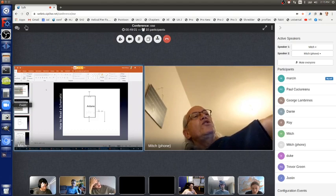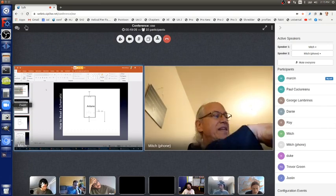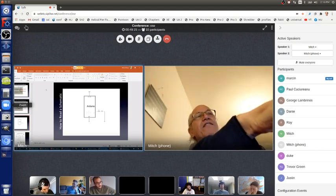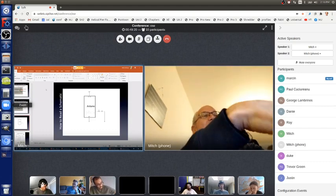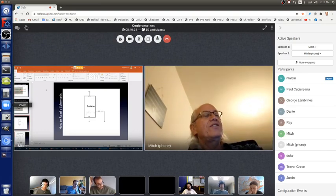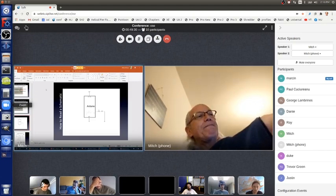And then there's only two parts. And they're connected to what's marked there, D13. D stands for digital 13, because there are those pins at the bottom, which I briefly mentioned, which are analog pins. Those would be A0 to A5. But digital is what we want to use, and that's D0 through D13. Some projects won't use analog, but I put D13 there. So that's the pin with the built-in LED.